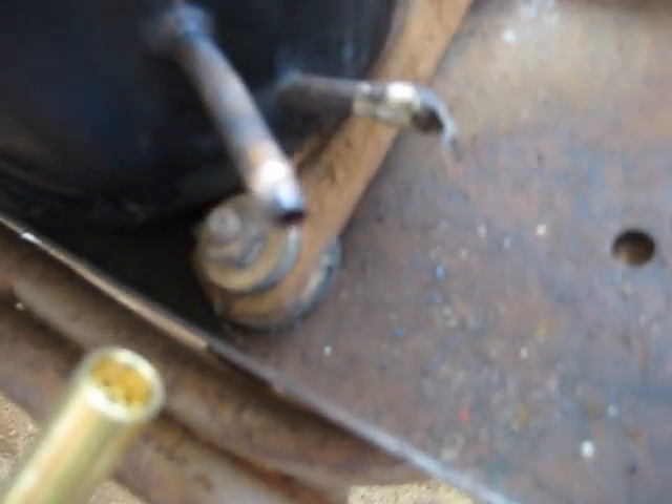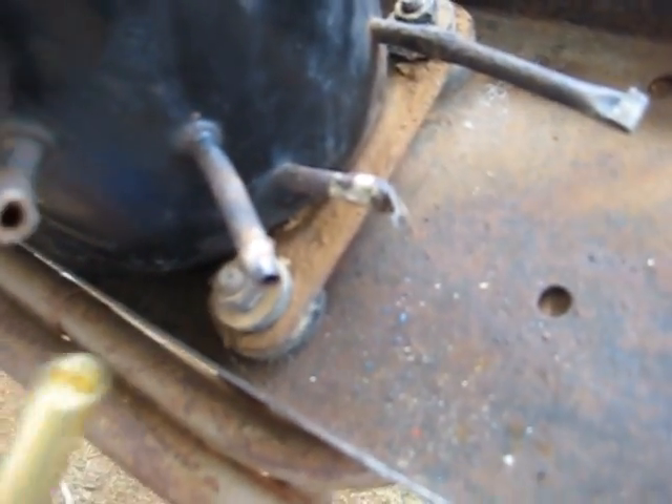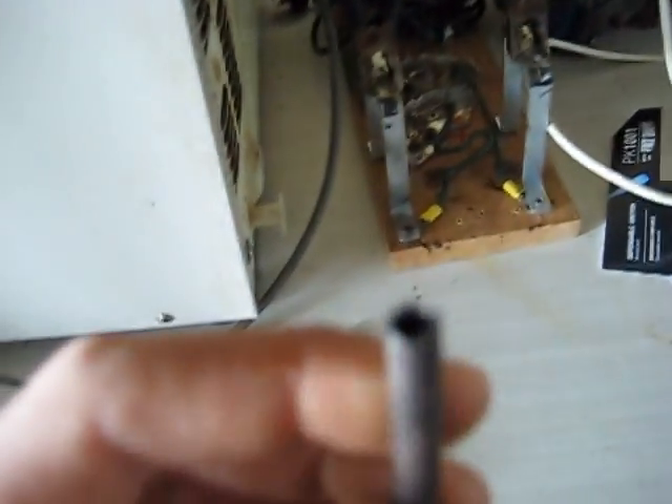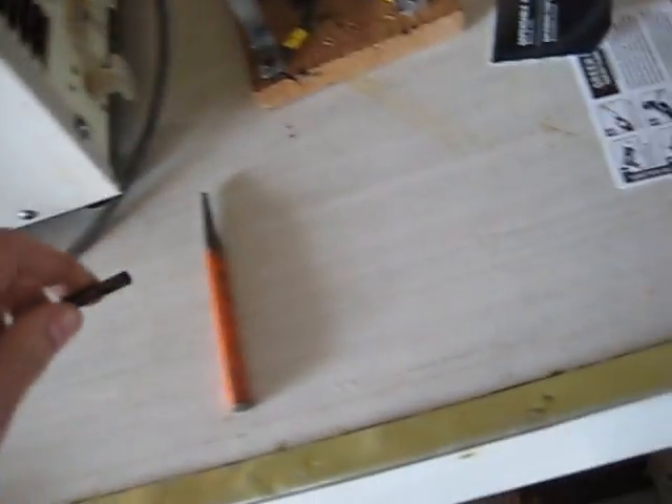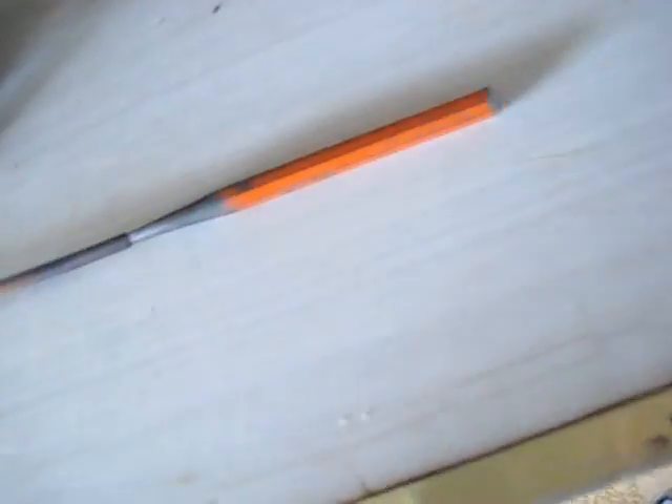That's the bit I took off down there. You do your work carefully with the pliers. As it starts to break loose, keep the heat on it — twist and twist and pull and it will come off. Now, once I've done that, I'll get the other piece to put on there. I don't have a proper copper pipe flaring tool, so I'm just going to stick this to the inside, push it, and smash it in with the hammer until I get the right size.